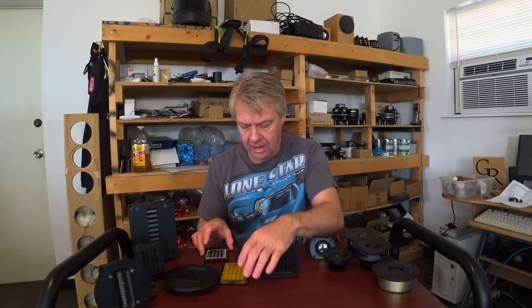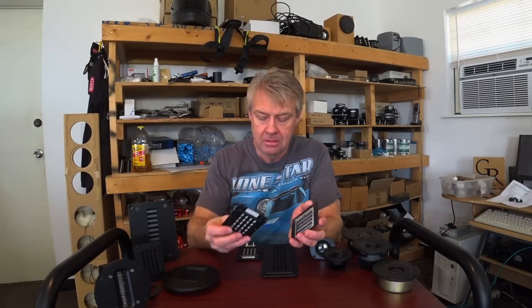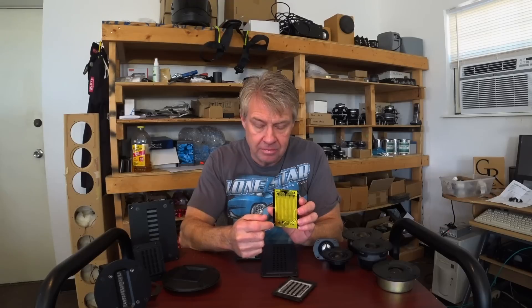In comparison to ribbons, we have the planar magnetic tweeters. This is one of ours — very different in how it's made. I have one apart here: the metal frame has neodymium bar magnets on both sides. There's an etched film running back and forth that's a conductive material acting as a voice coil. That's what the current is sent through — a thin line whose width versus length determines the appropriate impedance.